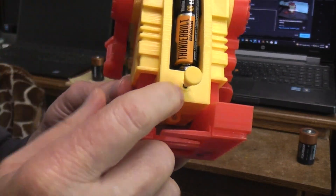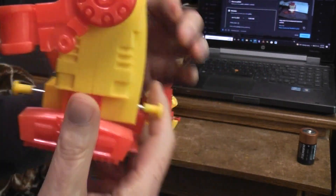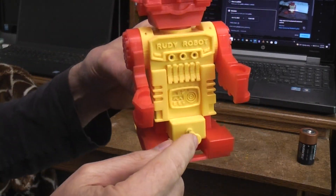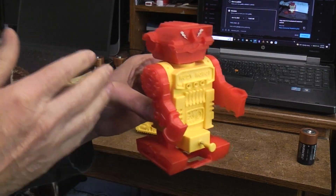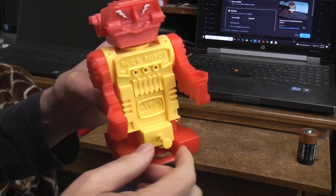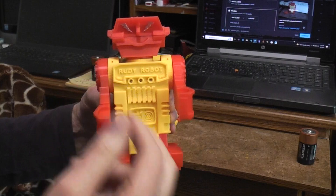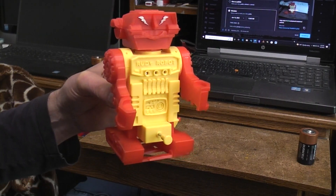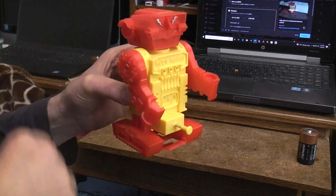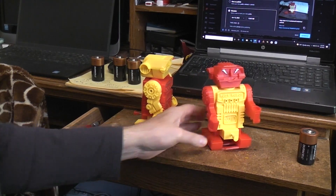It's not really visible here, but it is in the other videos: I did a whole brass tube insert that the metal rod rides in. That makes the electrical connection on the rod, which rides on the piece of metal, and the piece of metal goes back and sticks to the magnet to give you the reverse. In reverse, it's energizing the double pole double throw relay. When walking forward, it's just the motor running on 1.5 volts. The flashing LEDs run on the 5-volt step-up inverter at all times, and the relay only draws 5 volts from that step-up inverter when in reverse.